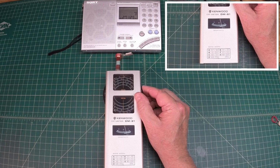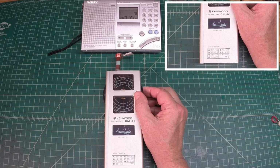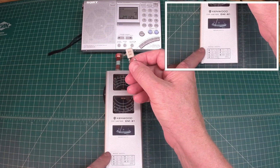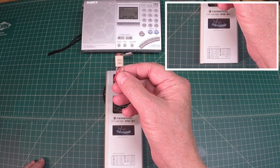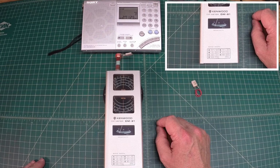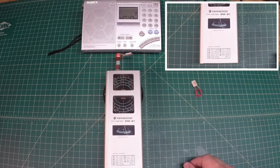But you can actually hear this thing dips down. You'll hear it resonate, and lock in at the desired frequency at 27125. So there you have it. Again, if you've got a dip meter out there and you've got a question if a crystal itself is bad, just one of the methods and procedures you could use to validate the usefulness of the crystal itself. Again, this is the one that came out no good. This is just another crystal here I had in the old goodie bag, just for I reckon future uses like this. So anyway, hey guys, just wanted to demonstrate that.